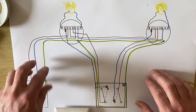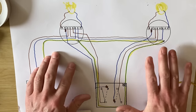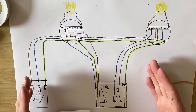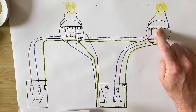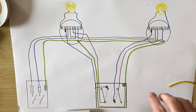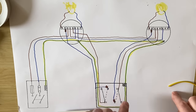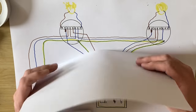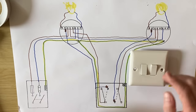In the current position, both these switches have the lights off. By changing the position of the blade — operating the switch — you turn on the light. We've got a two-gang switch: this one in the kitchen controlled by this switch, and the next one controls the dining area light. So we've added a two-gang switch to our drawing using the three-plate method. We can also look at this using the two-plate method. We'll also make one of these two-way — for example if this was the ground floor light by the front door, and this was the light at the top of the stairs, you'd always be able to turn it on from another location. Remember you can download the notes from the link in the description. Hopefully this has been a helpful introduction to a two-gang light switch controlling two lights independently.